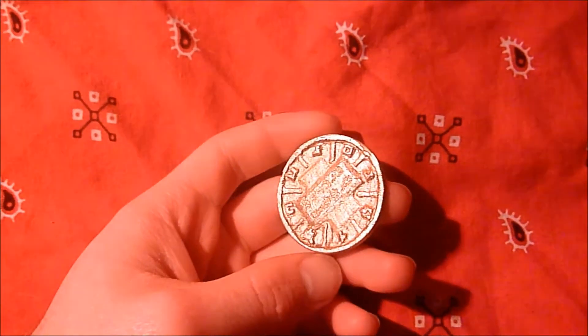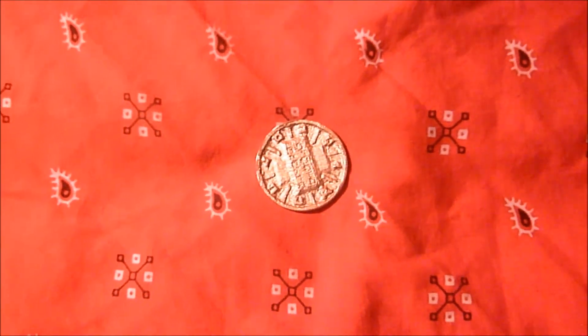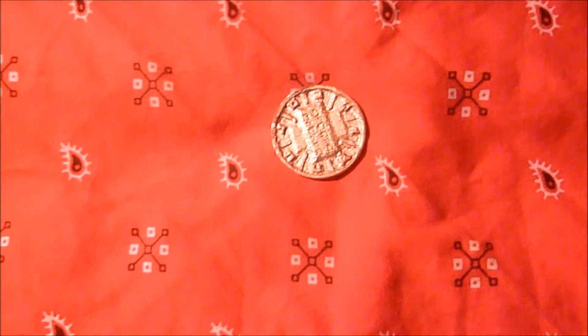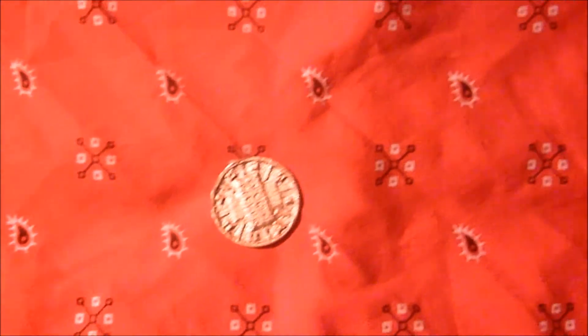This metal typically casts and sands very easily. It's 5% bismuth by weight, as well as 5% tin by weight. So it's about 90% copper, 5% tin, 5% bismuth. There's still some traces of zinc in there, but I think most of that's burned off by now.